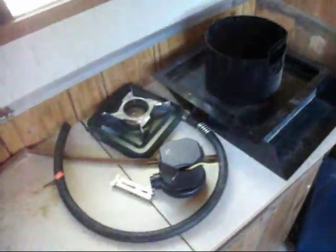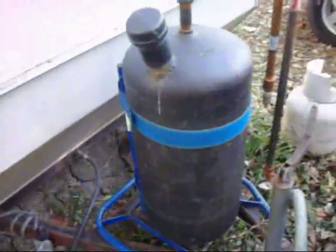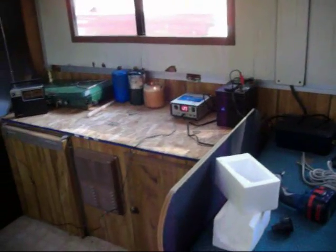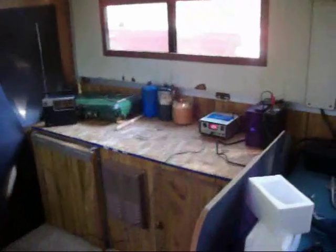I've got to figure a way to hook this burner up, because I've got the gasifier on the front of the camper. I'm going to use this little gasifier — the one I showed in a video where I was cooking and running the motor. I'm going to put it on the front like this, run the piping underneath, and then it's going to tee off on the inside up to something like that little propane cook stove. I'll build a little cabinet top on there, put it in there, and then I'll have the fan and control over here so I can start the fire, and then I'll have gas coming out that I can cook or heat with.